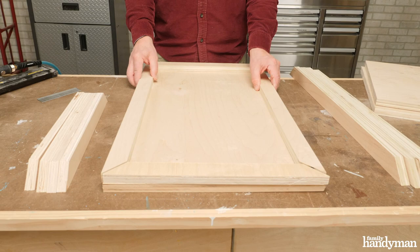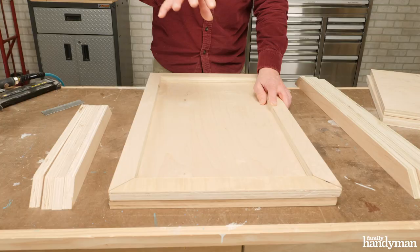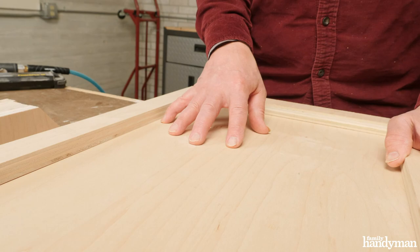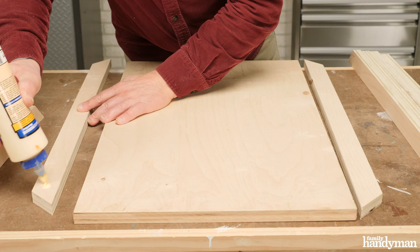To assemble the bottom, middle, and top platforms, add the inch and a half wide three-quarter inch build-up strips. They're already cut to length with mitered corners — make sure your outside edges are as flush as possible. Dry fit things first and make any miter adjustments necessary. Also check your platform panel to make sure you're putting the bad side down. Attach with wood glue and switch to one-inch brads so the nails don't poke through the top of the platform.